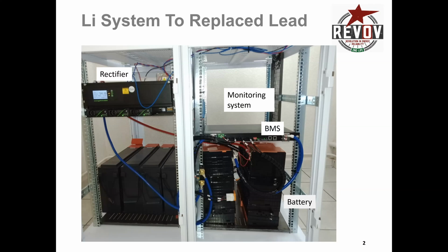I have noticed one or two clients have attached it to the first battery, and effectively they put in a 24 volt power supply to the BMS. In most cases, I've seen that the BMS carries on unfazed by the difference between 24 and 48 volts. I would prefer you to stick to the 48 volt, because I have had one BMS blowout, and I think it was due to that.